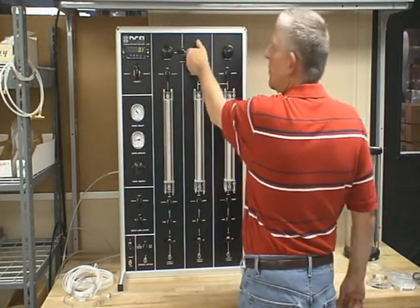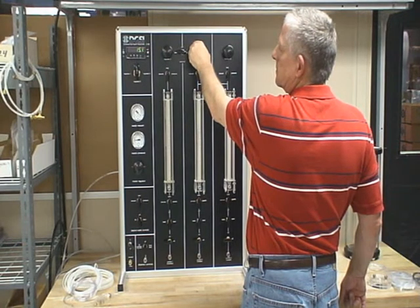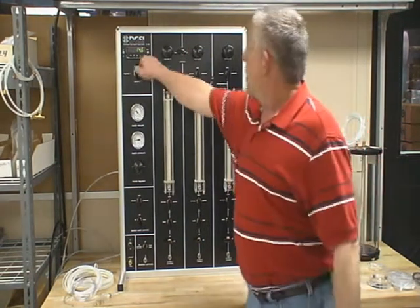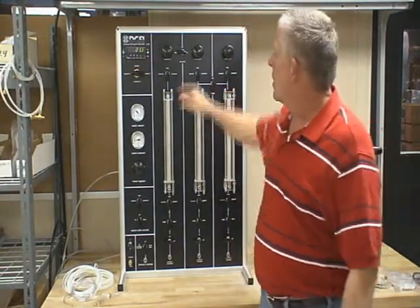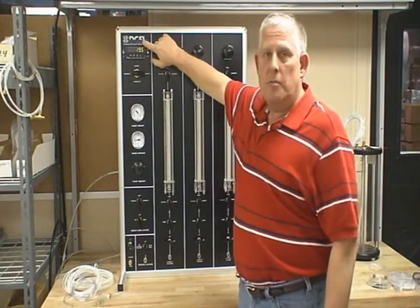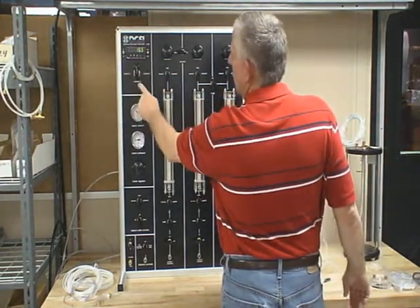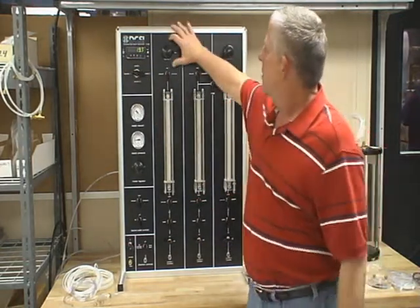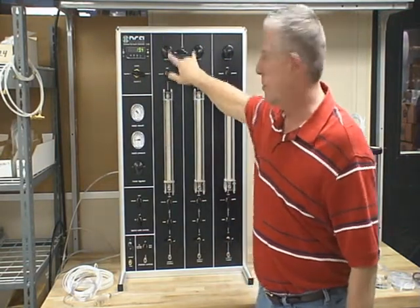Now I'm going to increase two to my first pressure of 15 psi. I'm going to go back and check my confining pressure. As you can see, it follows up. Occasionally you do have to adjust it — this is in metric so it's a lot more sensitive than normal. Regulator two is at 15 psi. Regulator one should be right at 20. Makes it a lot simpler, a lot easier to use. You don't have to worry about adjusting your pressures.